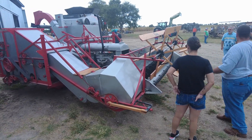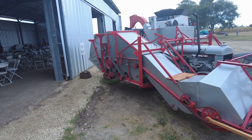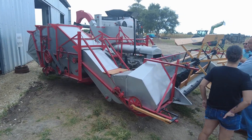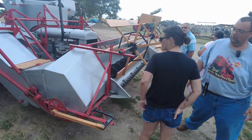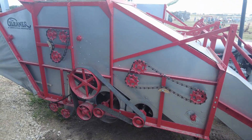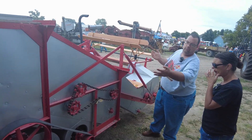It took what we looked at earlier and instead of cutting it out in the field, putting it on wagons, carrying it to the farm, and running it through the threshing machine — doing all that work in one spot there in the field. How it works is it cuts it, the auger pulls it over, then there's a conveyor that goes up into the threshing body — basically a mobile threshing machine. Like the threshing machine, it separates the grain and drops the rest out the back.